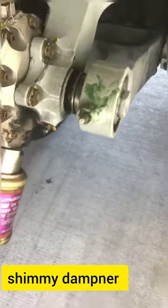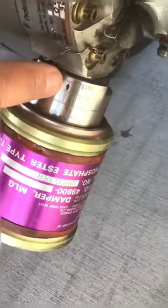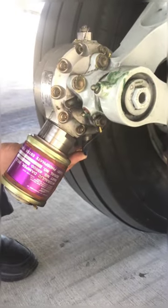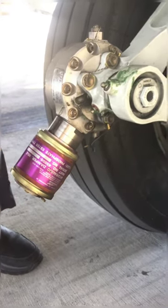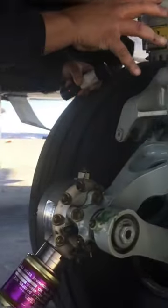A good place to check here — the shimmy dampener. This canister has to be in the full range. If it goes past into refill territory, you'll have to break the safety on this cap, hook up the hydraulic cart, and pump it about a quarter turn — then it will be fully serviced. They do go low, and you will get a called out if you don't inspect it properly. Again: the brakes, all your hydraulic lines, your prox sensors — make sure they're clean. Shake the door, make sure it's secure.